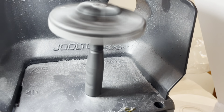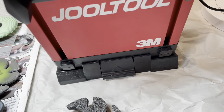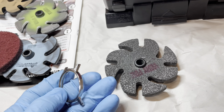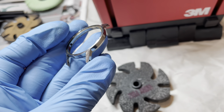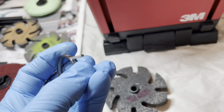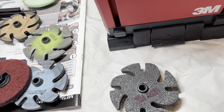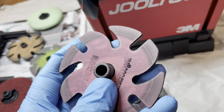So the first thing I'm going to do is use these burnishing discs, which more than actually polish, moves the metal around. What I'm going to try and do is get the worst of these gouges to kind of fill in themselves, and when we've gone over the entire case, removing or mixing in the worst of the scratches, we're going to start polishing it up. And I'm predicting I'm going to lose the facets on the top of the lugs. So when that happens, I'm then going to try and recut them with these lapping discs. And we'll see how good it gets.